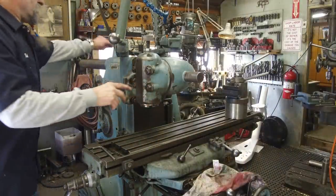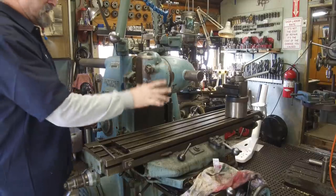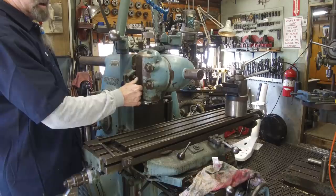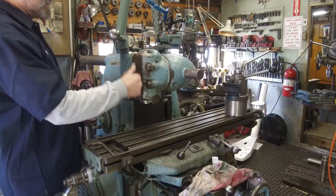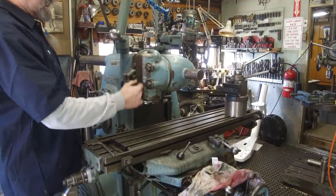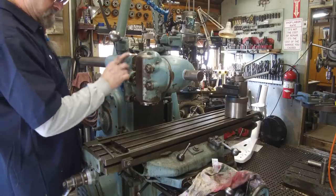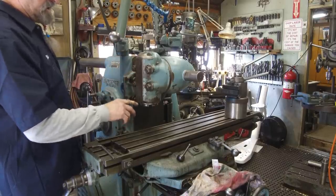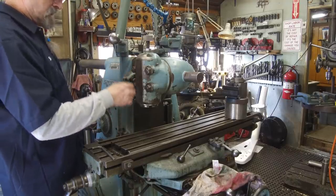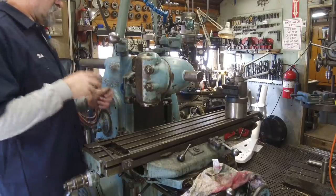We pulled out our chuck and we put in our adapter, got our universal head up here. Now this flat surface right here comes in handy to dial your head in. If you didn't know what this flat surface was, part of it is probably part of their jigging, but this is within thousands of being parallel to the axis, at least on this one here. I double checked it. All right, and I use it generally to do a quick location. So I'm going to use this surface to set this up to be 90 in that direction.